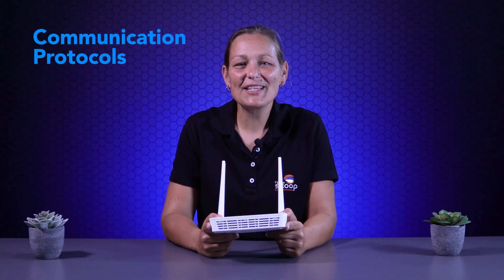The GP1200 makes use of the OMCI protocol to communicate with OLTs, and with it being a protocol defined in the GPON standard, it is compatible with many of the brands already in use in the field. This, coupled with the option of TR069, TR098, TR181, as well as Genie ACS support, gives ISPs a host of management options to choose from.